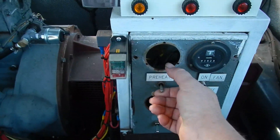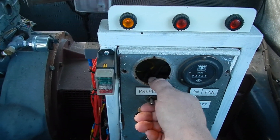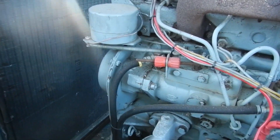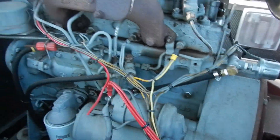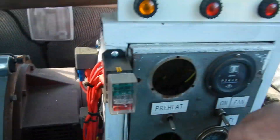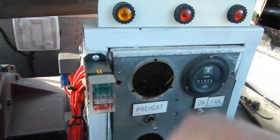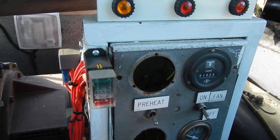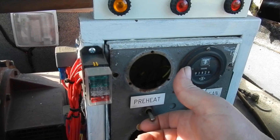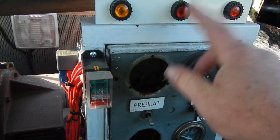With this setup, if you glow it — when you hit glow, it turns on the injector pump. And when it's got oil pressure, it turns on the injector pump. But with no oil pressure, it won't start. So I'll just give it a crank, get the oil pressure up — nice for the bearings when it first fires. Then hold the glow on so it starts, and then the light should go off. I've turned the ignition on.